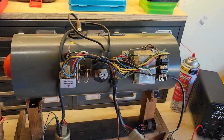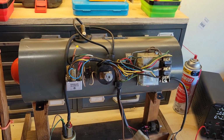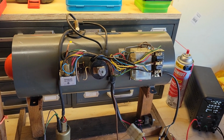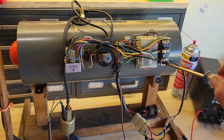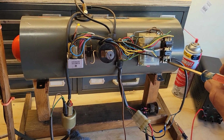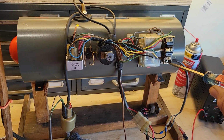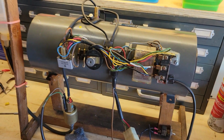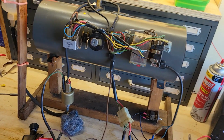Give it another 15 seconds. That's enough. Figure out which way to turn it. There you go. So that little adjustment is what controls the point to where it cools down enough to shut the heater off completely. So now it's ready to turn on again and run the cycle all over again in the wave pattern, on and off, on and off. Okay.